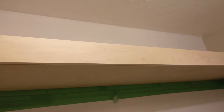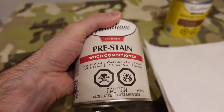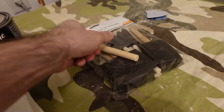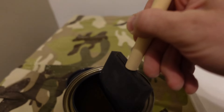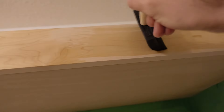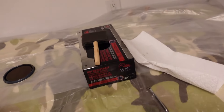I'm waiting for that to dry and then I'll take some 150 grit and sand off all the filler. I've taped up the wall so I don't get stain all over it. The first thing I'm going to do is lay down some wood conditioner, then two coats of stain, and the last thing is three coats of clear coat. For this I'm just using foam brushes and I do end up using some towels to wipe up the stain. For the pre-stain conditioner, it just paints on — it is a little bit runny so it will drip, especially when you're working overhead, so just be careful with that. I put on gloves when doing the overhead work. Then you let that dry for about 15 minutes, depending on which product you're using.